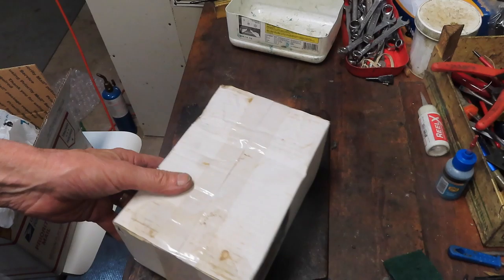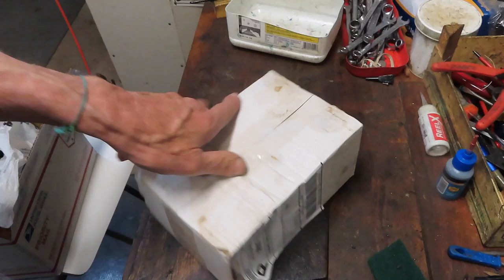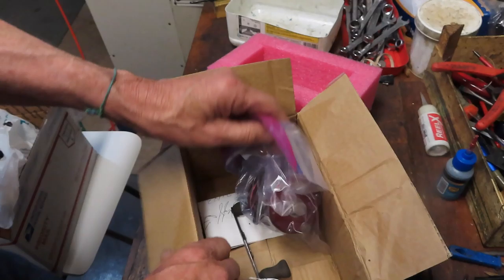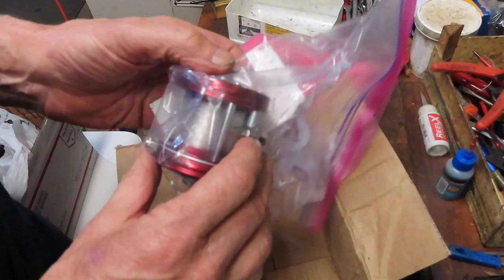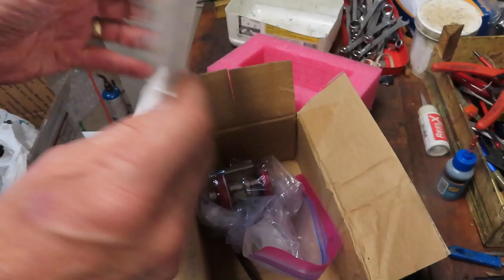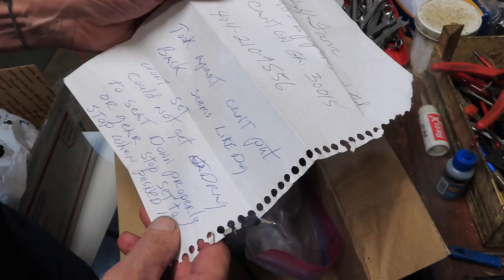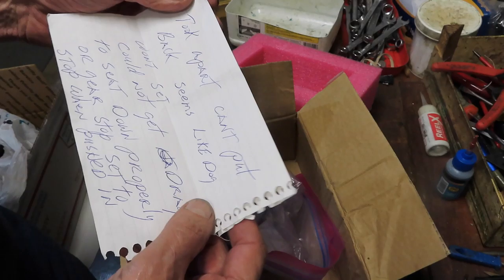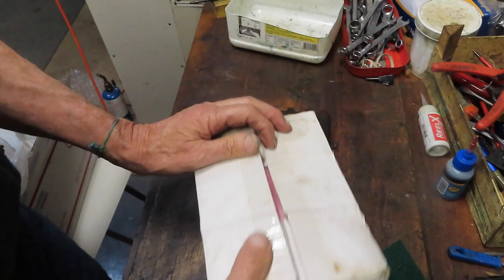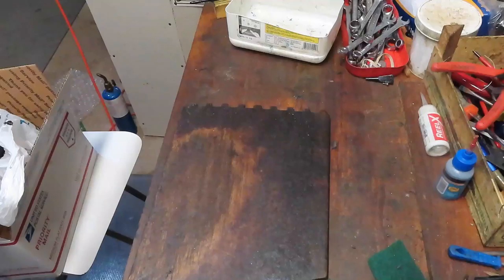Here's one from Jeff in Canton, Georgia. If you like to see these types of reel repair projects with problem diagnosis and repair, please subscribe to my channel and hit the notification button so you'll know when I post. Jeff's note says he took it apart and can't get it back together - the dog won't set. So we're going to help Jeff out with that anti-reverse issue and make sure that reel goes fishing again.